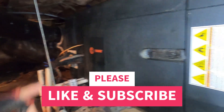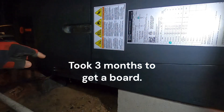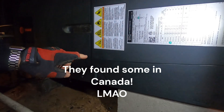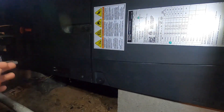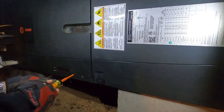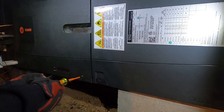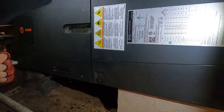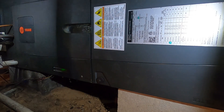This is one of the TAM air handlers I've done videos on. This one was from back in July where the outdoor unit wasn't coming on in heating or cooling, and the Y out from the board was stuck open. These boards have a built-in protection so that if you have any kind of freeze fault or a sensor issue, it can drop the call to the outdoor unit and get it shut down so that the coil doesn't freeze.